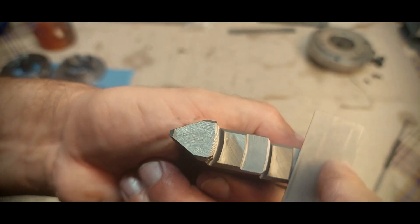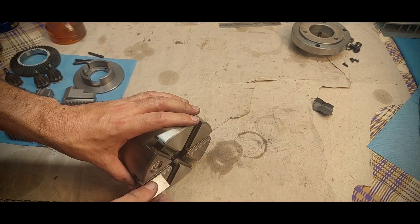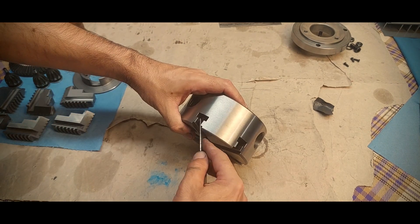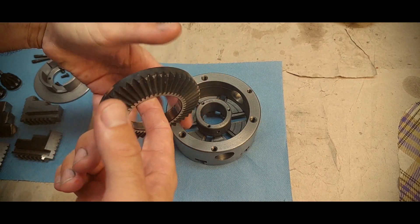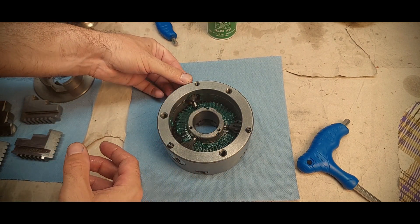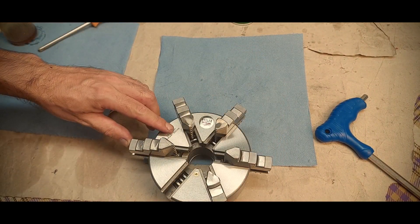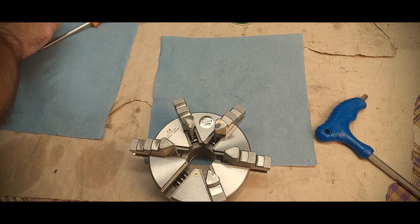And also, I don't want to be cutting my hands when using the lathe. After cleaning all the parts again, I started the reassembly. I used grease on the gears and oil on the scroll and jaws. The reason I didn't use grease on the scroll is because oil allows chips to fall off easier than grease. This is especially helpful after turning something that goes all the way through the chuck jaws. I always get some chips trapped in the scroll and using oil just makes cleaning easier.